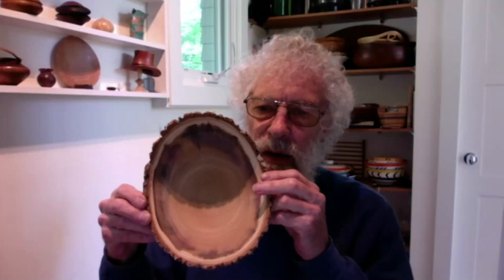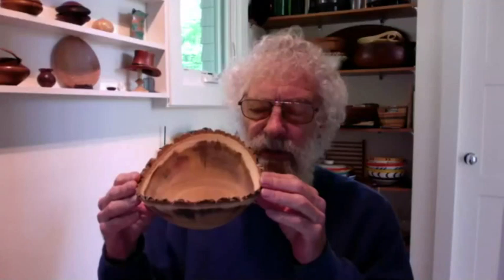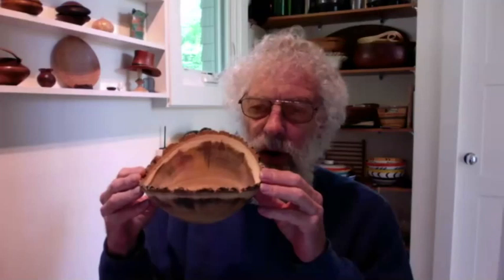How are you obtaining and preparing those blanks — are you bandsawing them out of logs? No, it could be bandsawed but these were not. I was cutting the log off at a certain height, then cutting it in half with a chainsaw, then taking that directly to the lathe and cutting the four corners off either with the chainsaw or while it's spinning around. A small bowl like this, the four corners are really no difficulty to turn off while it's spinning.